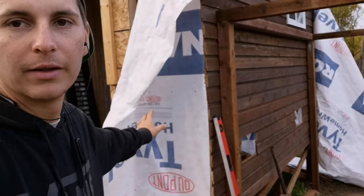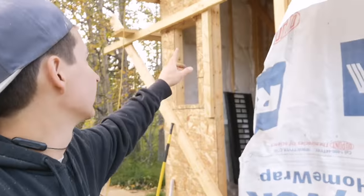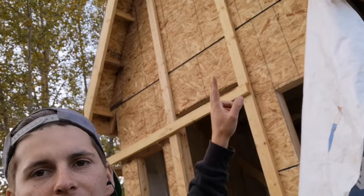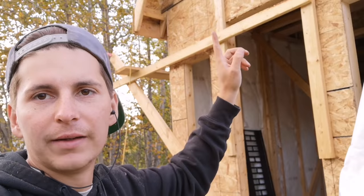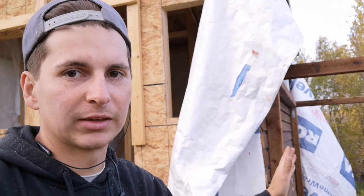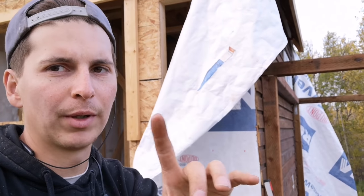I just want to explain why I didn't do the siding all the way around. It's because of the temporary scaffolding. The house wrap has to go all the way around, but there are these planks on the side. These right here are just kickers, so those could come off. But this here and down here, that has to come off before we can house wrap the whole thing. And we didn't do that yet because we didn't do the roof yet. So that's why we only sided the one side, because that's the one where we knew we were putting something on the coop. Hope that makes sense.